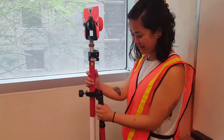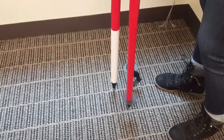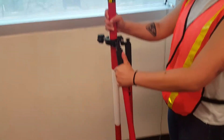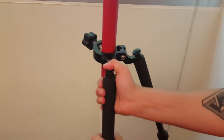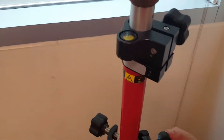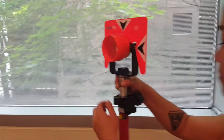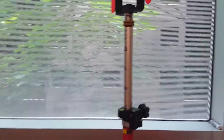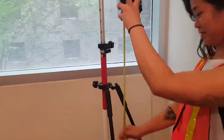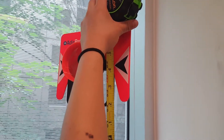Now we need to set up our bipod and reflector. First, make sure the reflector is secured into a crack or something that will not move. Then take the other two legs, set them out, and use the buttons on top to push and move the legs, leveling them using the bubble level. Once your reflector is nicely leveled, set its height so it is in line and visible from your Total Station. Use the knob to tighten the height, then use a tape measure to measure the height of the reflector.